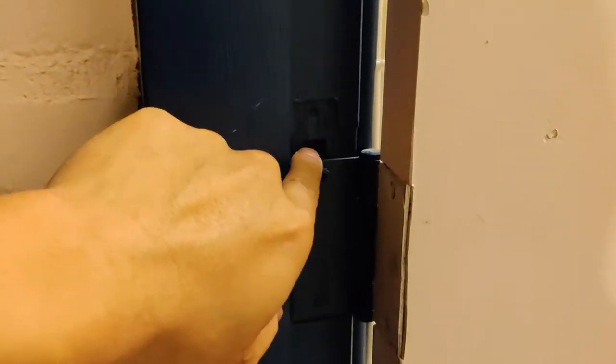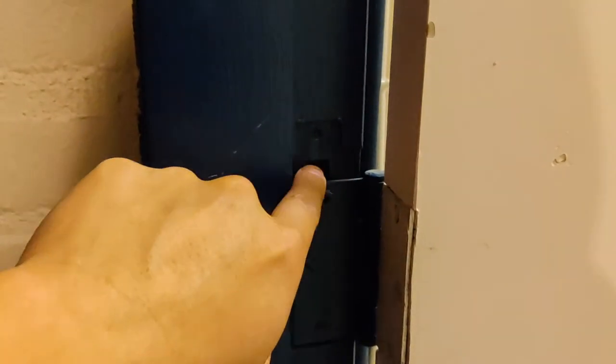It's interesting that this door already used to be a right-hand in-swing door, since the original hinge holes are still there. So all we have to do is unscrew the hinges and rehang the door on the other side. The original strike is even located right here, so we can reuse its hole.